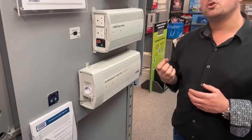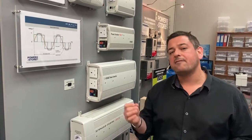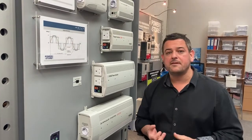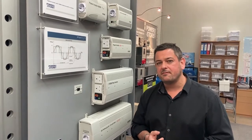The inverters are good for two things: running light loads for very long periods of time, such as power tool chargers or a notebook computer; and running heavy loads for short periods of time, so a hair dryer, a microwave, a kettle — those sort of things. What an inverter isn't very good at is running heavy loads for long periods of time. A good rule of thumb is that a heavy load is something that produces heat — so forget trying to heat water with a water heater or heat your vehicle or boat with a fan heater, because all you're going to do is discharge your batteries very quickly.